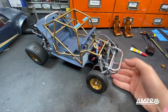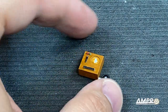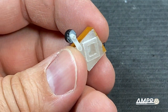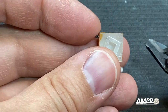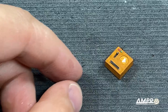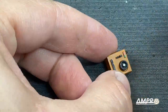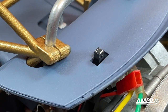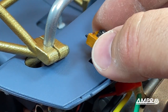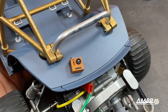That means our front steering system is taken care of, and throttle is taken care of. Next let's deal with the on/off switch. Here's the radio piece we're going to use — basically put it on top of the switch. Flip it over and you can see the little hole there. Use an exacto knife to clean this out. Now with the flush cutters cut this off on both sides and cut the back of the wheel completely flat. Put a little dab of model glue right in there, drop the wheel on, and make sure it's roughly in the center. The dimensions of the switch sticking out are 3.8 millimeters by 4.25 millimeters. It can be a press fit so you shouldn't need any glue. Squish it down and there is our on/off switch — you've basically just left your transmitter on the back of the car.